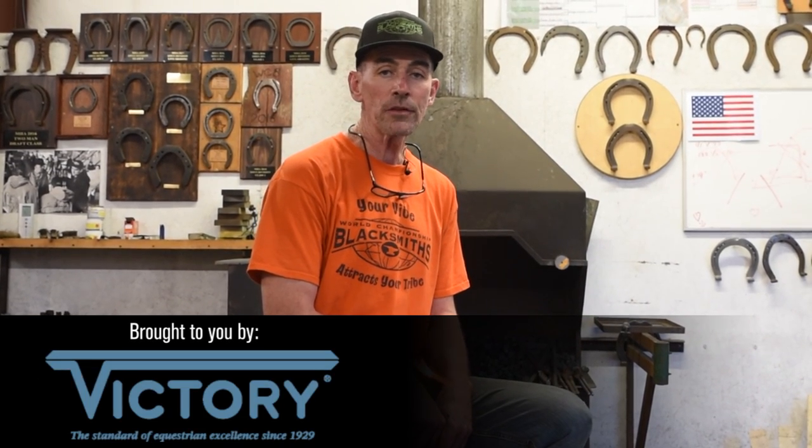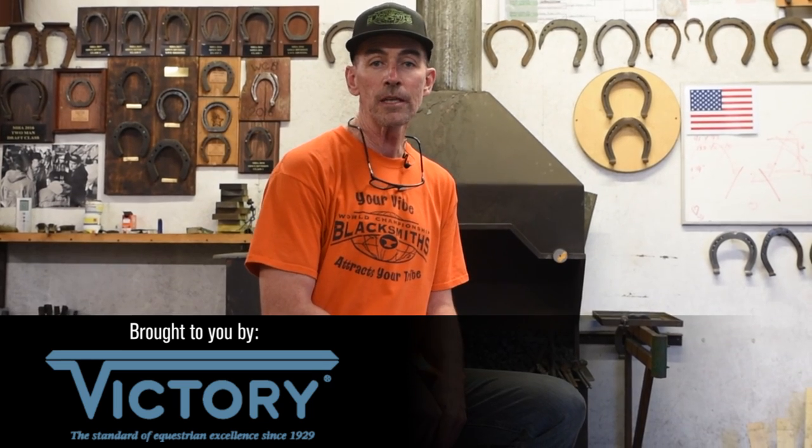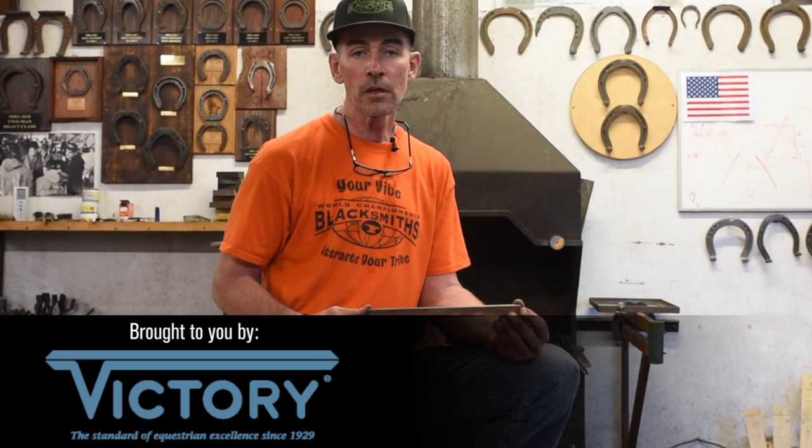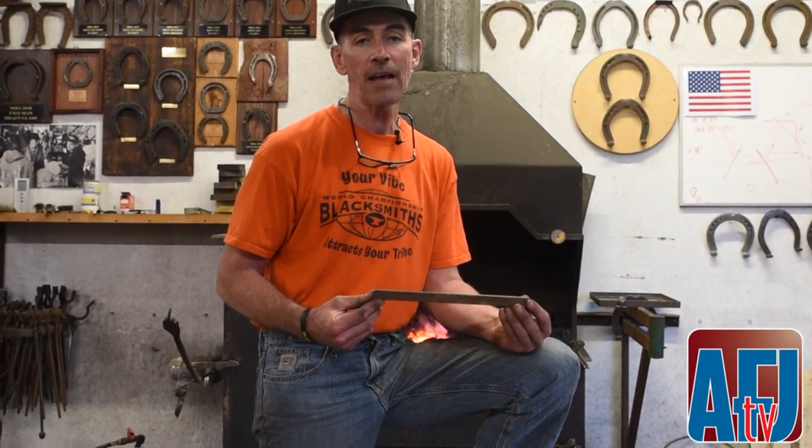Here in Edgewood, New Mexico, we're doing the mail-in shoe for the American Farriers Journal, and they'll be doing that contest at this year's International Hoof Care Summit. The sponsor of this event is going to be Victory Racing Plates. The mail-in shoe this year is going to be a sidebone shoe, made out of 3/8 by 3/4 by 11.5 inches long.